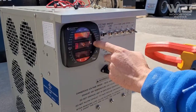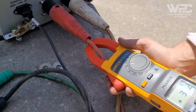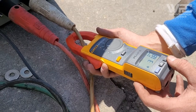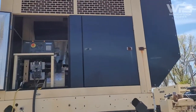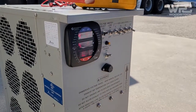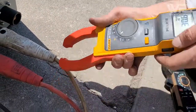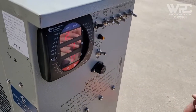We're getting about 31 amps per phase right now, and that's confirming with our meter — roughly 32 amps, and almost 32 on the other phase as well. At 50% load, we're seeing about 42 to 43 amps on line A. All is going well so far.